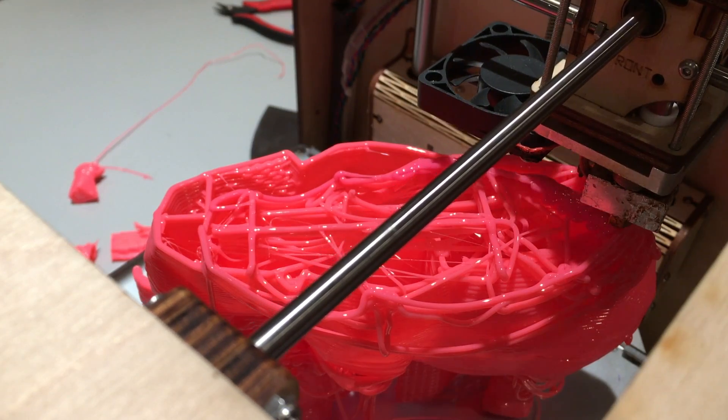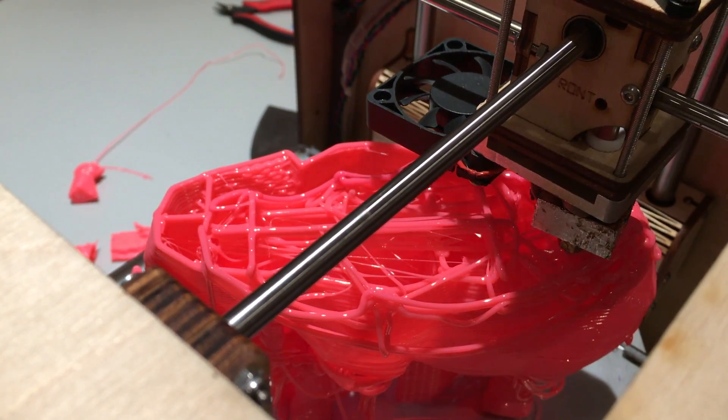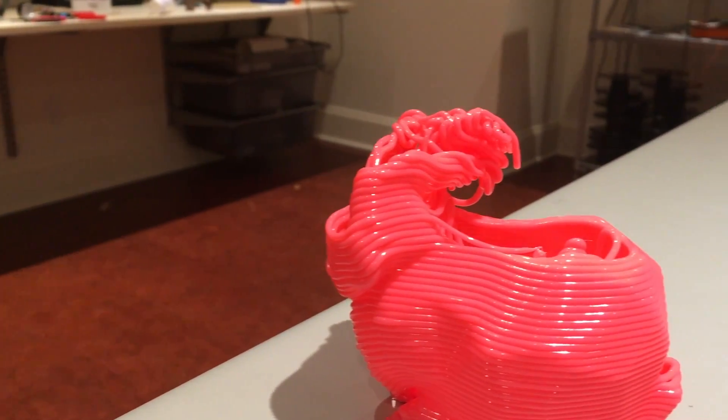As for the rest of the prints, results can vary quite a bit. On most of the standard prints I did, I had many issues, ranging from the lines curling upwards and causing the printhead to crash, or the extremely poor overhang performance caused by the massive layers. This leads into a greater idea surrounding printing with such a nozzle — basically, any artifact or unexpected symptom of normal printing is in a sense amplified by this greater layer height.